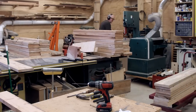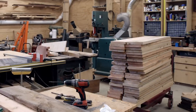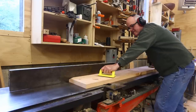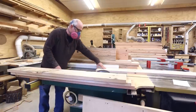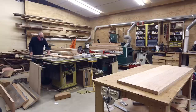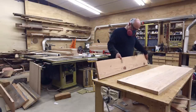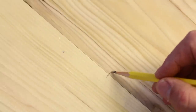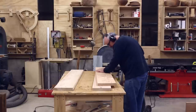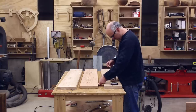There was lots of repetition on this project — this is about the second or third time going through the planer. I did a final pass on the jointer to give a nice smooth surface and ripped them all to a final width. In woodworking you're sort of carving things down, getting closer and closer to the final shape. With the tabletops I used biscuits to join the pieces together. I was lucky — using three pieces of wood was just about the right size for the table tops.